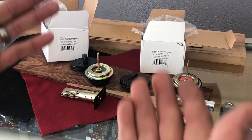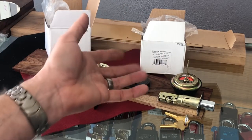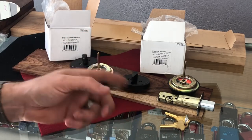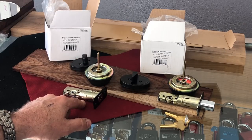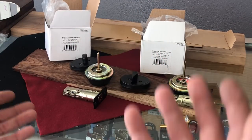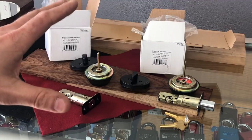That is just a quick update on something I've just discovered and I have not seen anybody else talk about it. All Schlage Dexter Builder's Quality locks — yes, they have apparently changed. Even though I personally very rarely saw the Schlage brand twist, and we saw it all the time with Defiant — that's why we gave Defiant kudos in that video, because they took the initiative to fix the problem by making a thicker tailpiece and changing the whole latch design. Apparently Schlage either gets these from the same factory, made a deal, or somehow infringed on their patent, but we are now at the point where Schlage Dexter is essentially the same thing as Defiant locks with just a couple of minor differences.